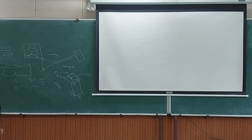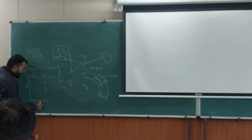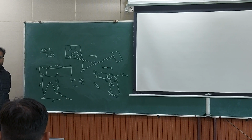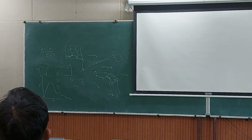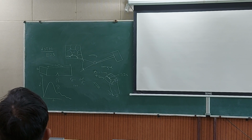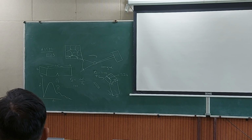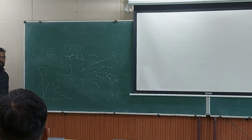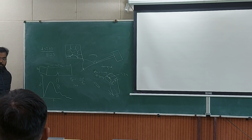Okay, so you will have to put a strain gauge on the hammer, so that strain gauge will give you the value of forces, and those forces will be oscillating because it is at higher velocity. Okay, so the force profile with respect to time you will get, and it will go something like this. And from this time, you have to estimate the amount of displacement which might have happened, or you integrate the area under the load versus time curve and estimate the value of energy. And that kind of testing is called pre-crack Charpy V-notch testing for fracture toughness.